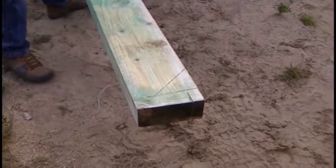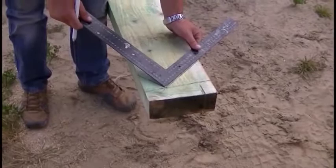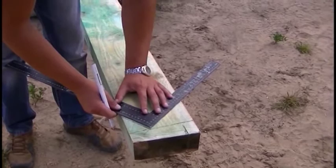We did it by dividing the height of the rafter into three equal sections. Then on the bottom we have cut out a third part, this way the top section will have a length of 2/3 of the height of the rafter. The bottom is cut to the level, while the front one is vertical.